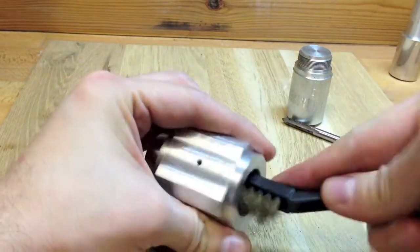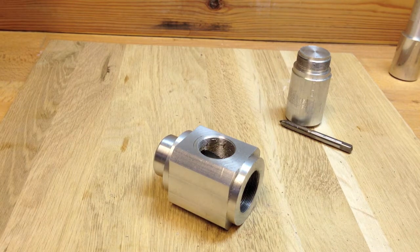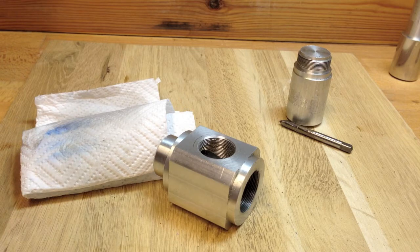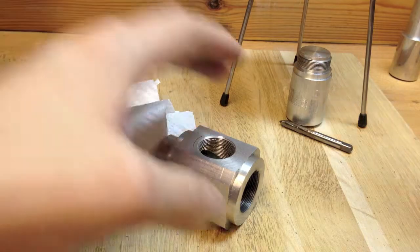Let me just proceed on this tack for a moment and clean out this crud. I might use a bit of solvent in there as well, because there's so much cutting fluid and WD-40. I've got a bit of xylene here which will dissolve the old oil quite effectively. I'll use my little crucible — an evaporating dish — as a receptacle and give it a scrub.